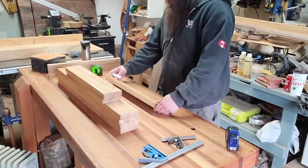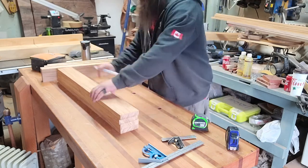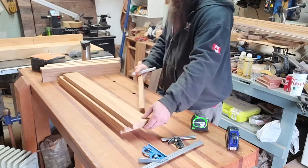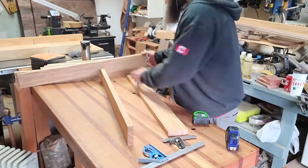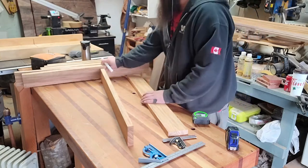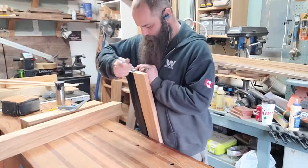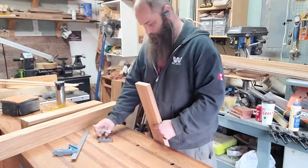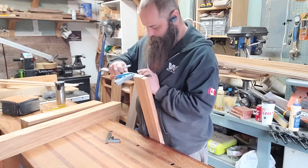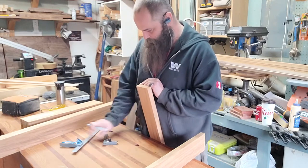This is probably the most important stage in creating a piece of furniture, at least to me — going through all of your wood once it's milled up and deciding exactly what piece goes where, which face faces which direction, what's the top of each one so that the grain is cohesive. Especially when you're going to be cutting curves into stuff, you want the grain to not be fighting those curves.